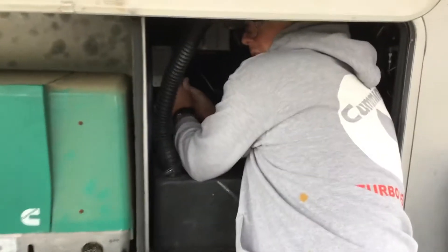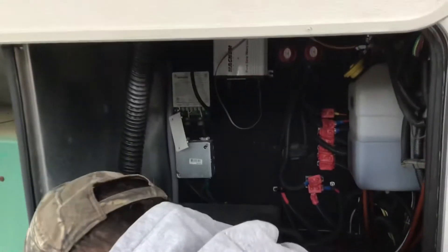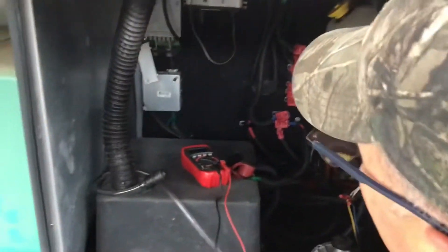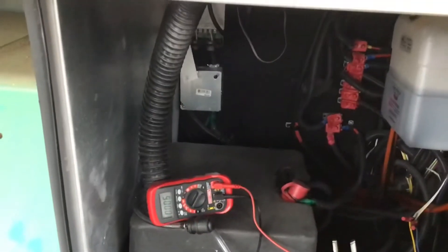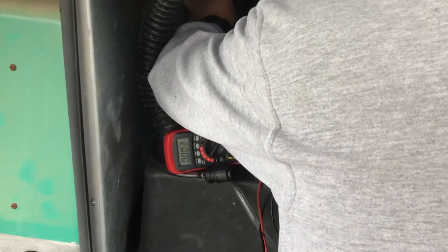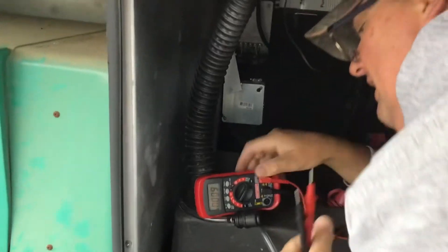The first thing I'm going to do is take the bottom plate off here to gain access to the electrical wiring. Once I have that off, I'm going to switch my multimeter to voltage AC to do a check. The hot leg is supposed to be on the right side. Okay, so that means I did get all the power off, and that's what we wanted to verify.